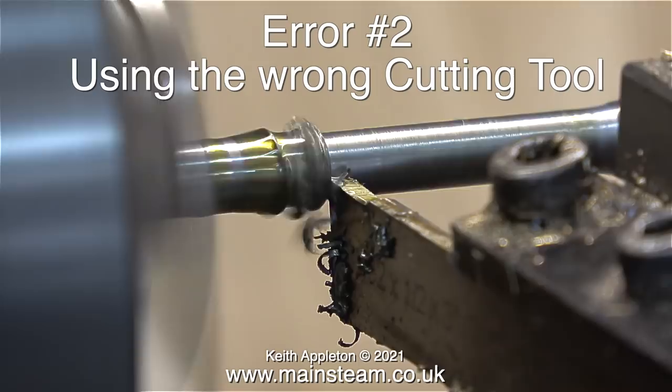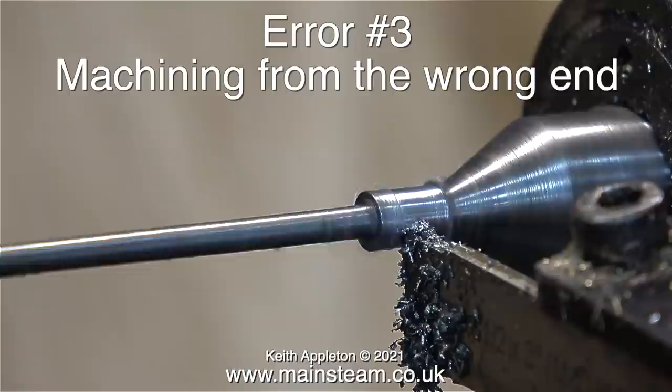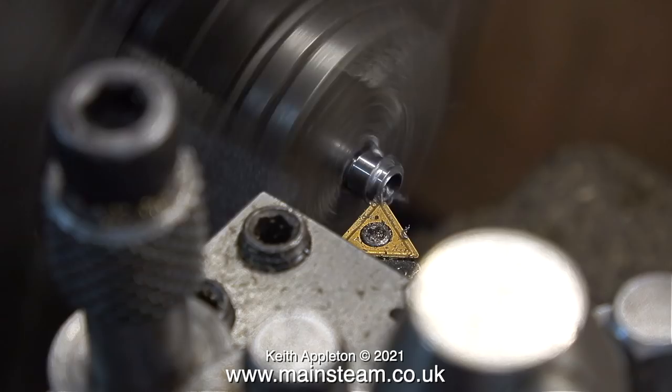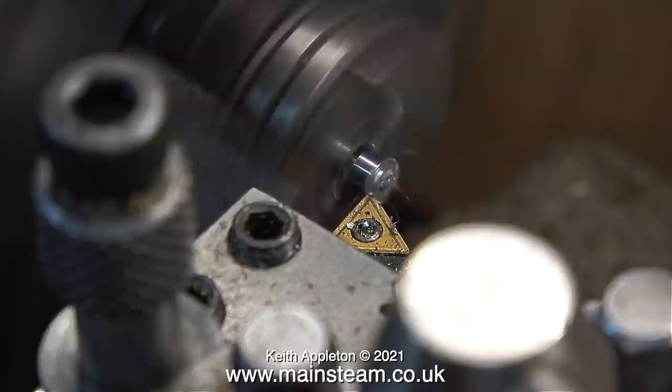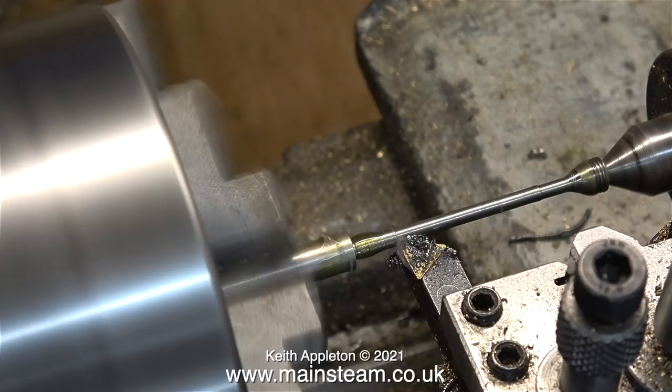To use the micrometer the way I'm doing it, I would have to work from left to right and not right to left. Error number three: I'm machining from the wrong end entirely. Although I used my micrometer to test the size of the shaft frequently, using the cutting tool from right to left meant I had to turn down the shaft for a sufficient length to apply the micrometer — so the pin came out undersize, and when I finished the head it left a bit of the center hole visible, which is not desirable.